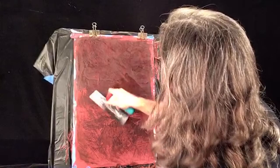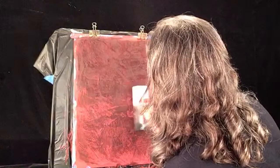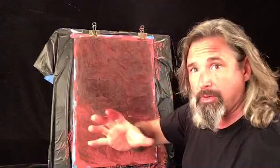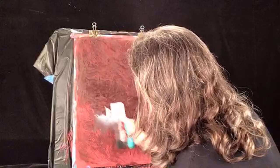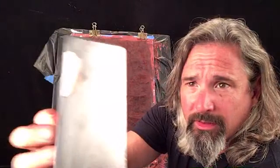Same way as applying the plaster — the trowel is almost flat, it's sliding off, up on the edge just a little bit to remove any excess. Look — that's 100% dry. You can clearly see how the wax darkens it up, because it's putting moisture into the plaster. As it dries the moisture dissipates and it just has that beautiful look. You can see the wax is grabbing the color.